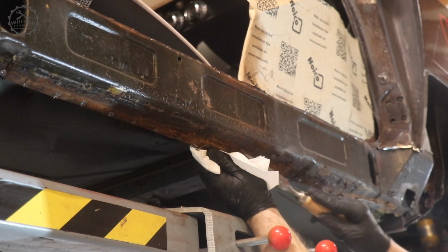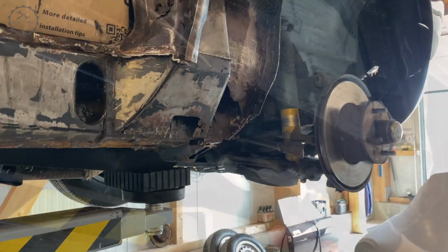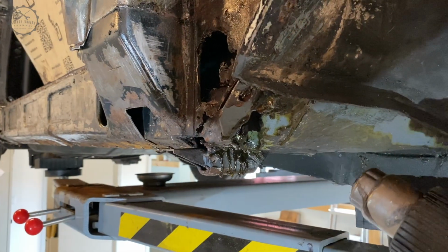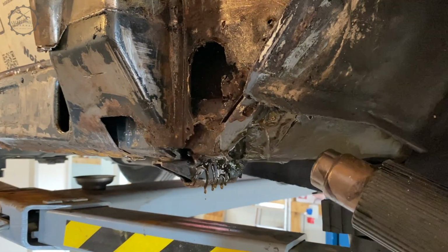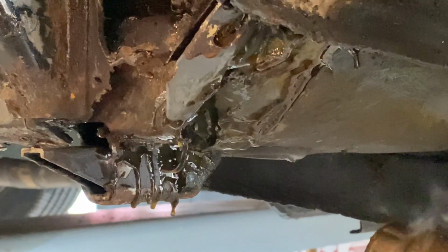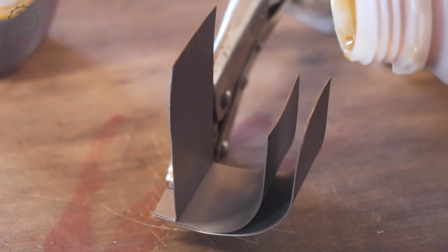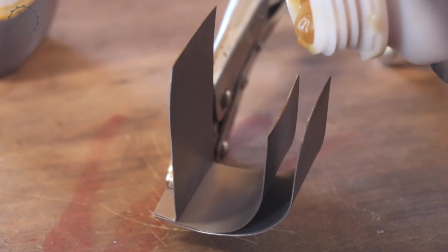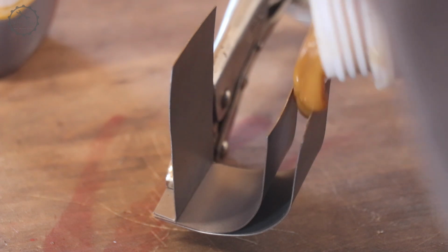There cannot be a Greasy Fingers film without the usual 2-minute rant about people's weird ideas to do rust protection. Ridiculous amounts of grease have been dumped in and on this poor car, but as could be seen in my last video, it just doesn't work that way. The sills of Alfas of the 60s are made of panels that are stapled under acute angles. And in these crevices, that's where the rust begins. Grease is much too tenacious to penetrate them.